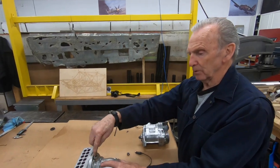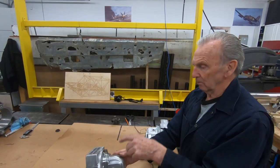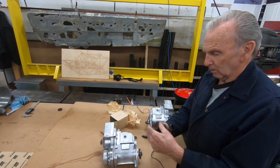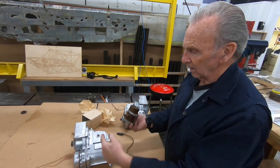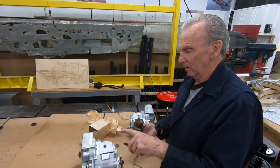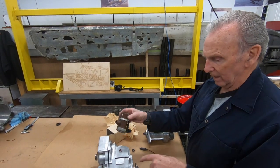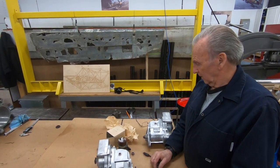The top fitting here is where the shower of sparks goes in to help starting in cold weather. This is a vibrating spark coil — it takes 12 volts on the top and it's just a vibrator that makes continuous sparks. The coil wire goes in here and over to there, so when you push the button to make this vibrate, you've got a continuous shower of sparks going on to the rotor wheel. It sparks in absolute no relation to the rotation — this is just helping you start the engine when it's cold and burn the fuel. It's seven degrees behind the actual ignition spark to give you enough juice to make her fly.